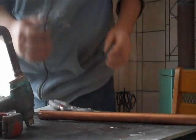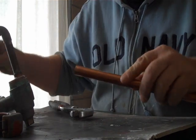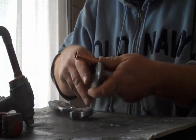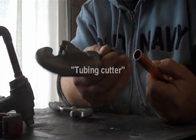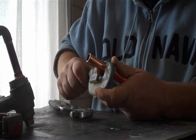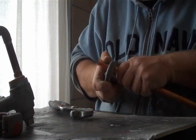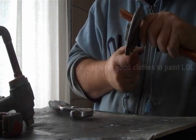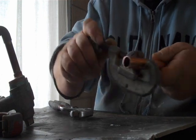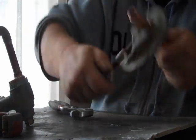I took some careful measurements and got a piece of pipe here I'm going to cut. This is called Type M or Type L solid copper pipe — rigid. Type M is a little thinner-walled than Type L, I can't remember which. To cut copper pipe you'll need one of these pipe cutters — they usually look like this in the hardware store. You clamp your pipe cutter on there like that, give it a twist, spin it around the pipe several times, another twist, and just keep going until the pipe splits off.